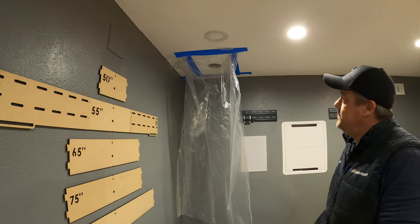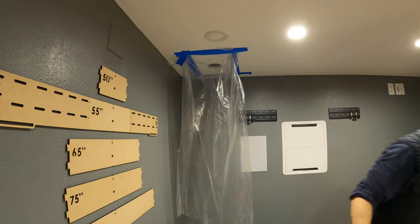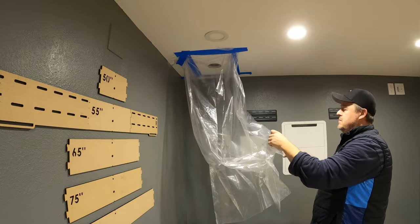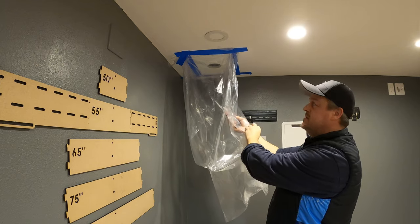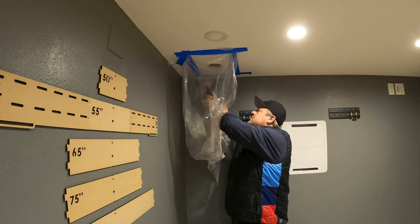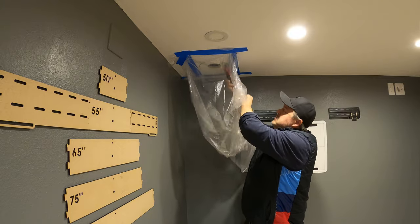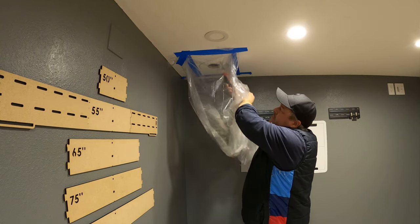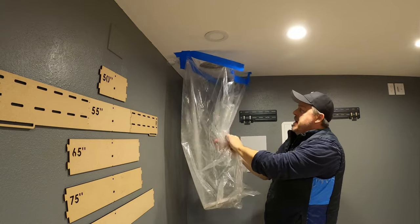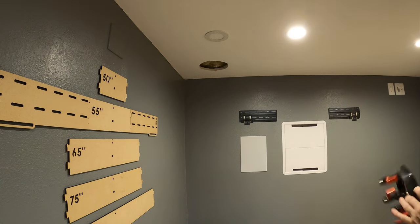I don't really like the way the corners tape, so I'll take care of those corners. It's completely taped off and sealed. I wanted that one big because I'm going to take a keyhole saw. I always go at the bottom so I can kind of work my way in. I'm making a small little hand-fold — you could even tape your hand if you're worried about dust. Then I'm just going to take my keyhole saw. Once it falls, it'll fall into our bag because we're holding the bag, and then I can pull my tape off, grab my hand, and grab all the dust. Almost no dust falls to the ground.